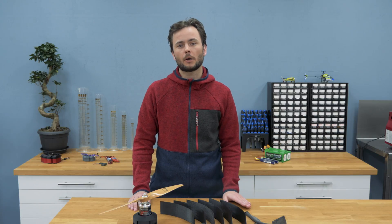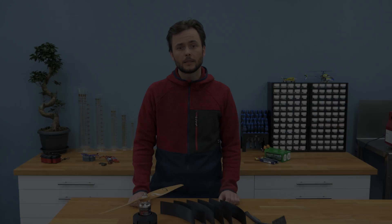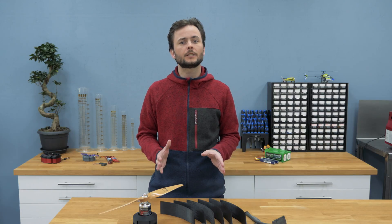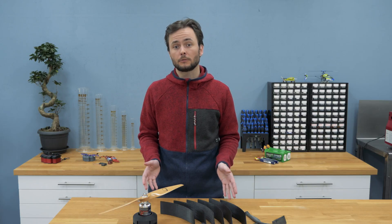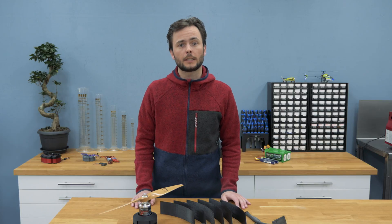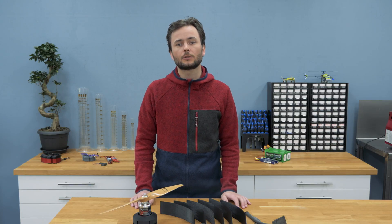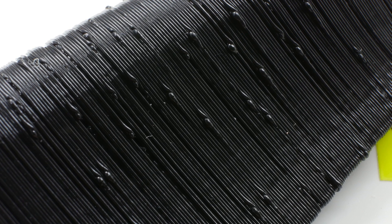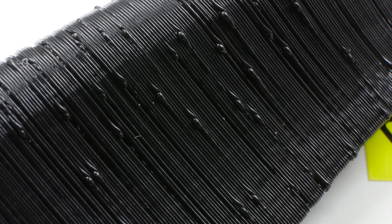At the moment it's a bit of a hack job, but it works so it's fine. The first parts came off in a decent shape, nothing special and nothing to worry about. But unfortunately it changed quickly in the prints that followed, and it got worse to the point that I had no choice but to stop and figure out what was wrong. You can see big blobs combined with a lot of layers that have under-extrusion, and if you look at the right trailing edge of the part, you can see that the layers do not align nicely.